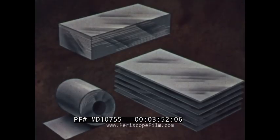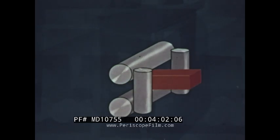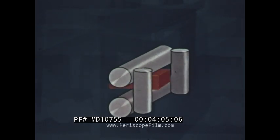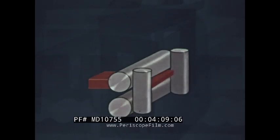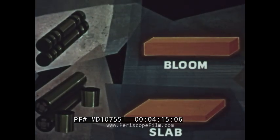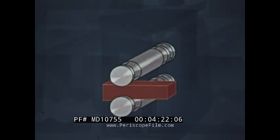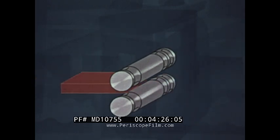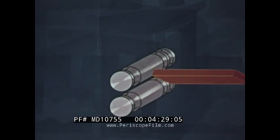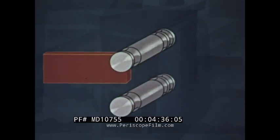Blooms can be rolled into structural shapes and similar products. Sheets, strips, or plates are rolled from slabs. The horizontal rolls for slabs are plain, and a pair of upright rolls rolls the edges of the slab. The slab is passed backward and forward through the mill. In plants where it is required to roll both slabs and blooms on the same mill, a third type known as the high-lift mill is used. For milling blooms, there are grooved passes; slabs are rolled between the flat sections of the rolls. The edges are rolled by turning the slab on edge. The high-lift housing allows the rolls to be separated far enough to take the width of the slab.